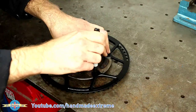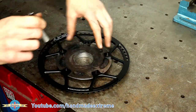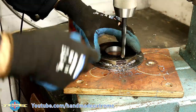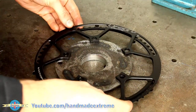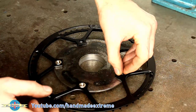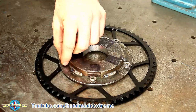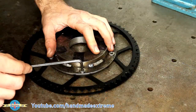I then just used a little Sharpie pen to go around and mark the positions of the screw holes. These don't need to be super accurate so I'm just drilling them through, because all of the locating is done off the outside diameter of the hub — the bolts are just there to hold the two bits together. The bolts are little special ones that you actually use on a bicycle for holding the chainring onto the crank set. They just have a little allen head screw and a special nut, done up with a normal allen key.